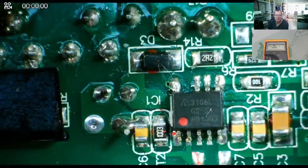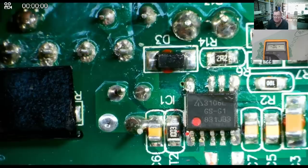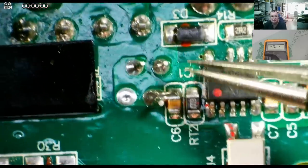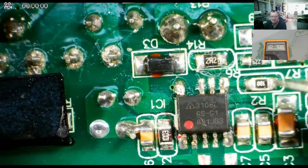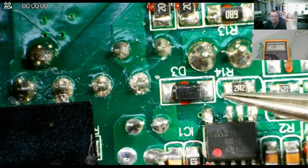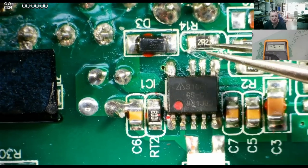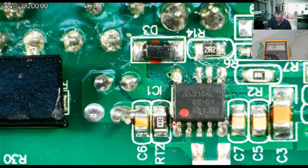And this is, if you've watched my other videos on power supplies, we can sort of figure some of this out. So we've got a diode here next to it. Yeah. This diode most likely will be part of the circuit that powers this up. So effectively there'll be a high value resistor normally that starts this. And then once you get started, the power supply comes back via the transformer on another secondary, not the one that drives the main output, and that via the diode will power this up permanently, if you like.